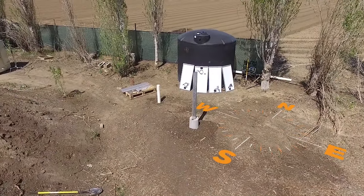At this point you have two options. One is we can go ahead and drop our pump down our well without our solar panel set up. But we always recommend testing in a bucket of water if you have it available. In this case, we're going to mount our solar panels, get our bucket of water, test our pump with the controller and solar panels hooked up, and then the final step is dropping it down our well. That way if we have any issues with our splice or say we forgot to label our wires, it's going to be very easy to troubleshoot at the surface before we drop it down.